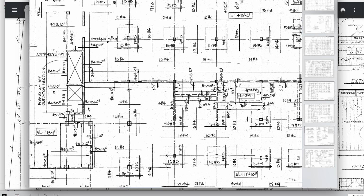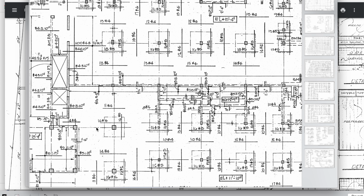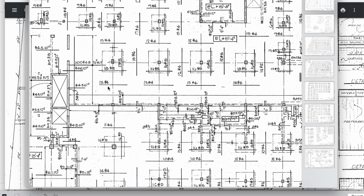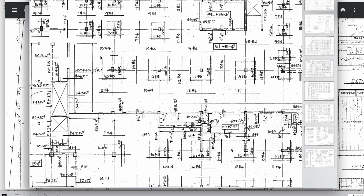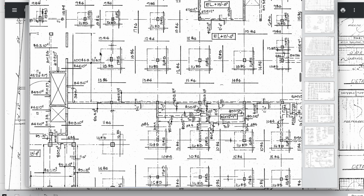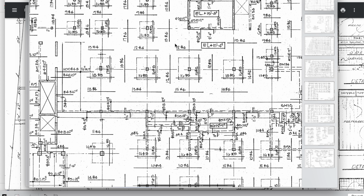Aha, very interesting, right? So we have a pool deck that went down. We have an area where it could go across and start pulling on the structure across this transfer beam, making its way into the structure and taking out the corridor till it made it over here. But we don't have that. So now we can start bounding our collapse, our initial collapse. So now we can say, okay, it didn't go there. It didn't kill the corridor because they left through the corridor.